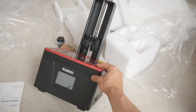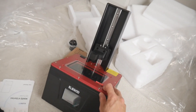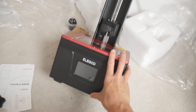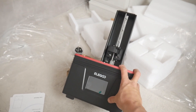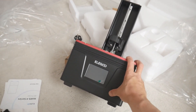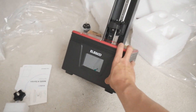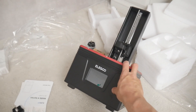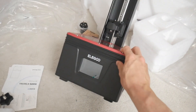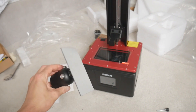For 500 pounds, what you're paying for is that DLP projection. Although on paper it will have a lower resolution, it will actually produce a more accurate print. You can't compare the resolution of a DLP projector to that of a, say, Mini 8K — they're two completely different technologies and not comparable at all. The build quality is actually really nice; it reminds me of my Saturn 2.